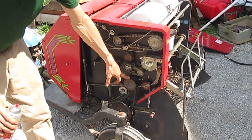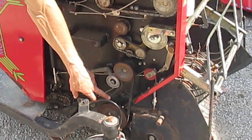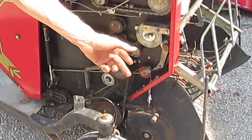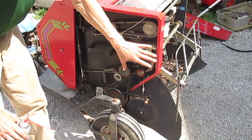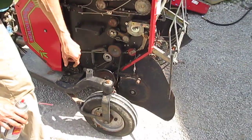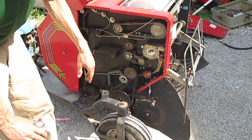This belt here is taking the power from one of the rollers down to the pickup wheel. The belt provides some slippage — it's a spring-loaded belt, so it keeps automatic tension on itself. However, if you overload the pickup wheels on the front of the baler, say taking in too much hay or picking up a big stick or a rock, and you jam the pickup, you'll shred this belt rather than breaking any chains. This becomes the shear point — it's the thing that's disposable. Removing the side panel lets you access that belt. It's about a 33-inch long belt and can be bought at any auto parts store; just bring along the old one for sizing.